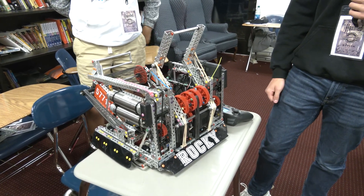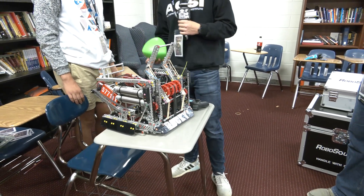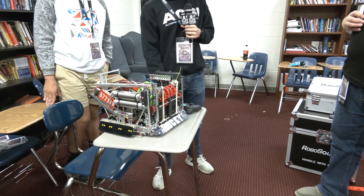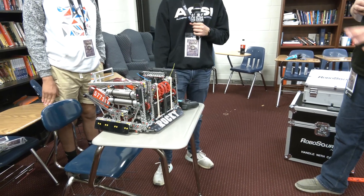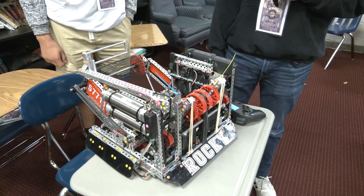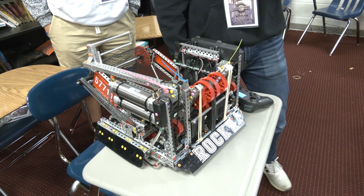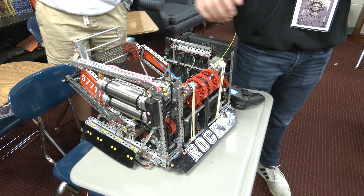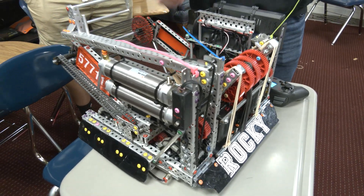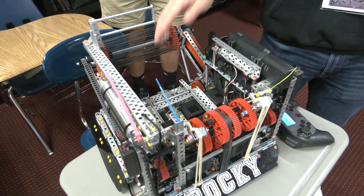Can we see what one of those shots looks like? Let's see — and you put it there. It looked like you had a couple of automated processes programmed into that. Yeah, so we use a PID control loop in order to have the catapult go down to the exact same spot every single time. We have two rotation sensors that we take an average of to get one value, and we use that PID loop to get to the exact same spot every time — basically a program to keep that catapult down throughout the entire match.